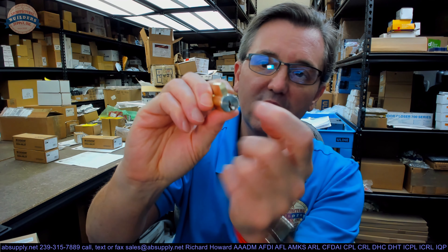On the outside, you will have either a free-operating trim — meaning no cylinder — and then a deadbolt, or you are going to have a keyed cylinder in the trim along with a keyed deadbolt above. But the interconnected, regardless of the function — passage below or keyed lock below — from the interior side, you will just rotate the trim and it will retract both latch bolts if the deadbolt is thrown, allowing immediate egress in a single action.